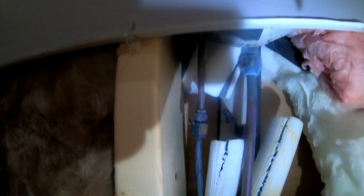But anyway, neither of these flare nuts look like they're leaking. I'm going to go ahead and break this loose so I can pull this out. There's no oil here. I had no leaks to start with. A year and a half ago, everything was tested to 500 psi and soaped. Pulled it down to 150 micron. It held, I think I left it overnight. It was still like 200 micron in the morning. The next day, everything fine, dumped it.